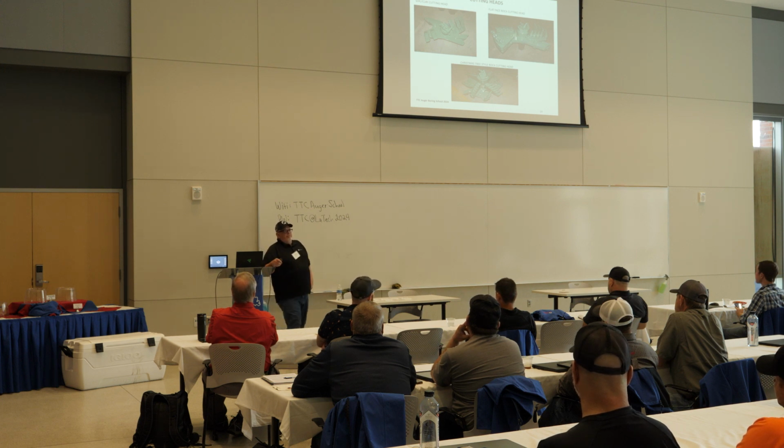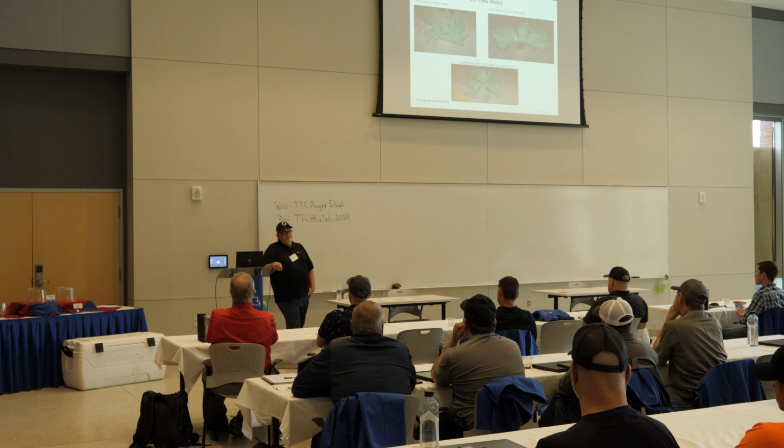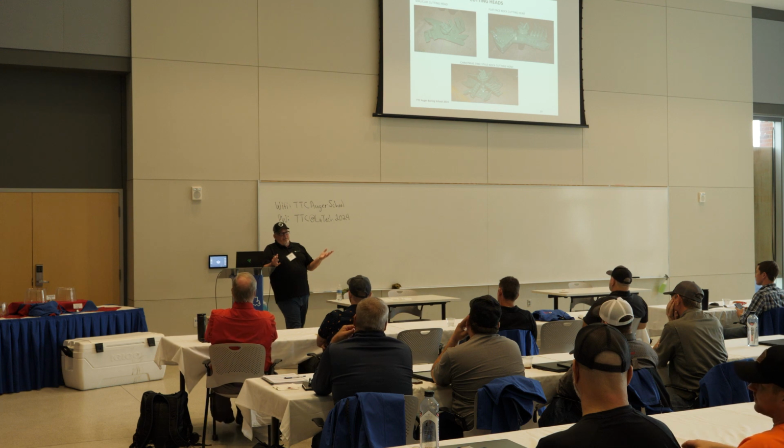How much water are you referring to? A gallon? I'd probably say 100 gallons a minute if you could. So say a 2-inch pump would probably be enough. Depends on what volume you're using too. So you've got a lot of volume here to fill up and move. You may have to go up to 3 or 4-inch just to get enough water over there, because you're filling up auger tubes.